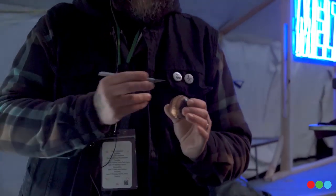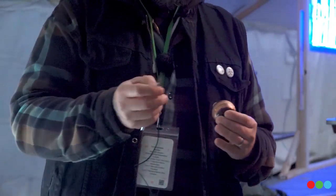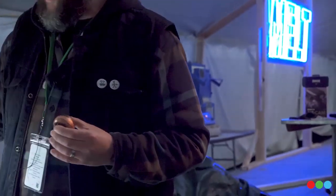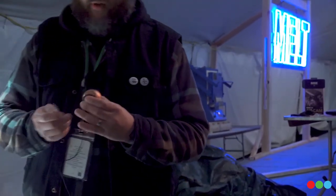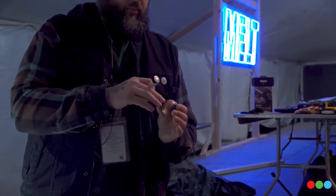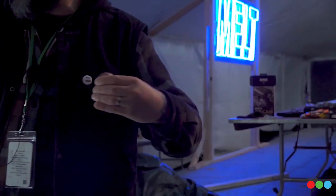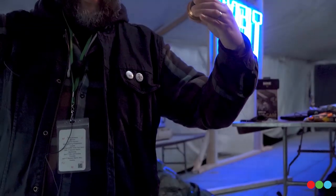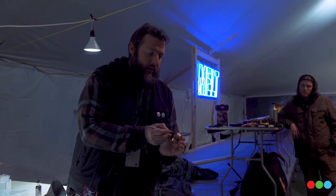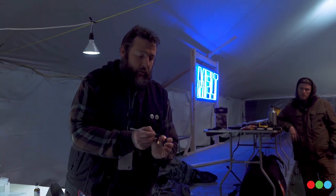A lot of times when I go to trim out the paint, I'll just throw a new blade on, but I'm also conscious that these new blades are covered in oil. So I'll pick it out of the little container, wipe it off really well, put it on here, and make sure my hands are clean. What's cool about trimming these out is it's really easy because you sort of carve down into the glass. The smooth glass is up a little higher and it gives a really good surface. So I get this nice and level with that edge, and you can just watch it scrape right up to it.